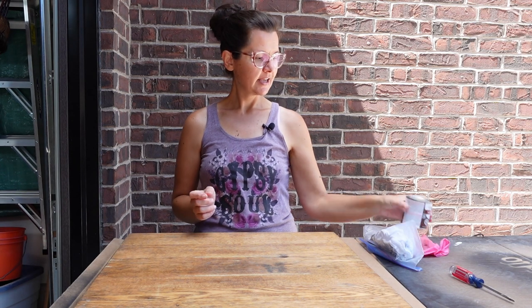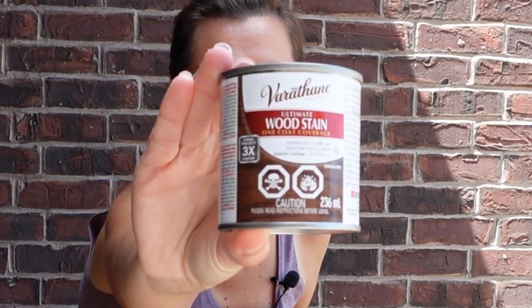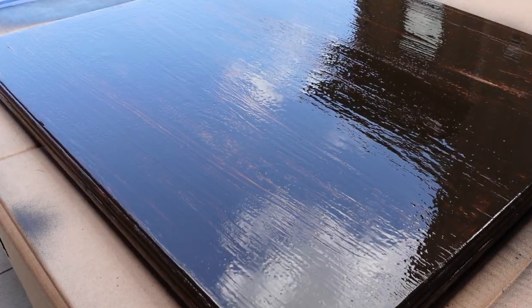It's been 30 minutes and in the meantime I've baked a batch of muffins, and now I'm ready to stain. This is a new stain color to me — it's called chocolate, which sounds good. I'm hoping it's a dark chocolate, not a milk chocolate. The color is too light — I wanted it richer. When I wipe it off it gets this lighter, almost a little too golden color. So I'm going to let it sit for an hour and then give it another coat of stain and let it sit a bit longer than recommended — they recommended one to three minutes; I might go five.